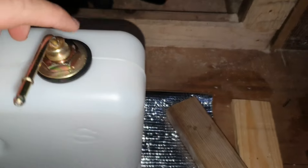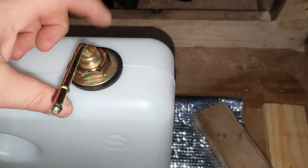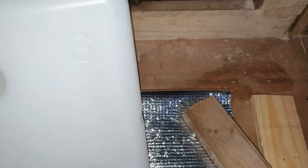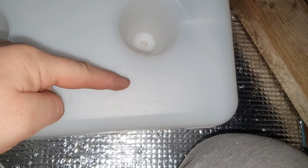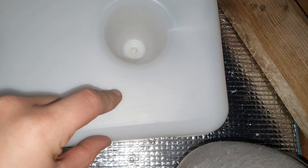And there you have it — the rubber goes on, the washer goes on, and then screw it down. That is now nice and tight. I don't know if the camera picks it up, but the pipe ends about there, which is exactly where I want it — letting the rest of the rubbish and fuel sit at the bottom.